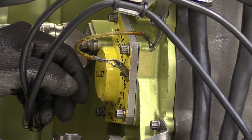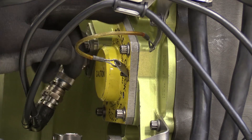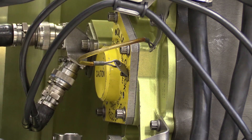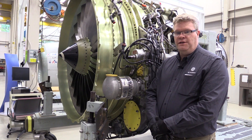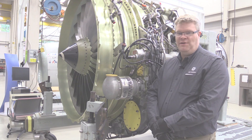As we go back into service, we're going to have to do our aircraft maintenance manual repair confirmation procedures, which is going to include an idle run and a leak check. I want to verify that I don't have any fluid coming out of this drive pad cover, and then we're ready to go back in service. That completes this maintenance minute of the removal and installation of the N2 drive pad cover. Thank you very much. Have a nice day.